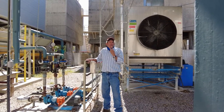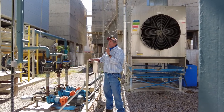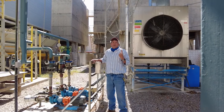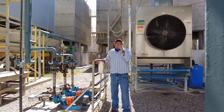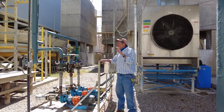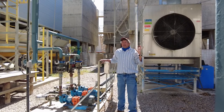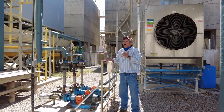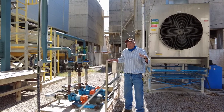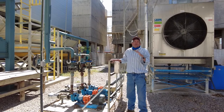Two of the fuses blew. One of the fuses did not. In fact, a 200-amp fuse allowed 600 amps to go through it and did not blow. We had equipment all over campus that was out. Research equipment, and we had problems for a year and a half. My group spent $1.5 million fixing everything. I don't know how much insurance money.